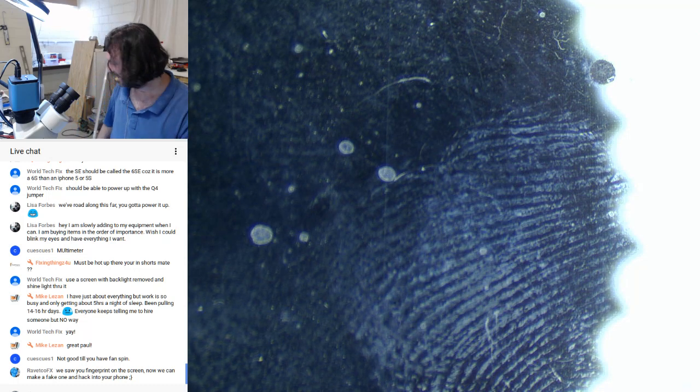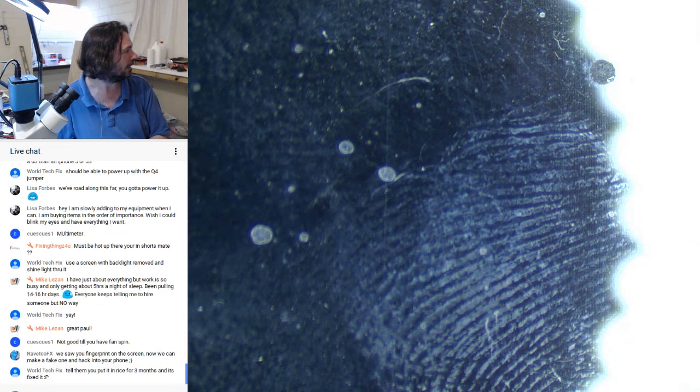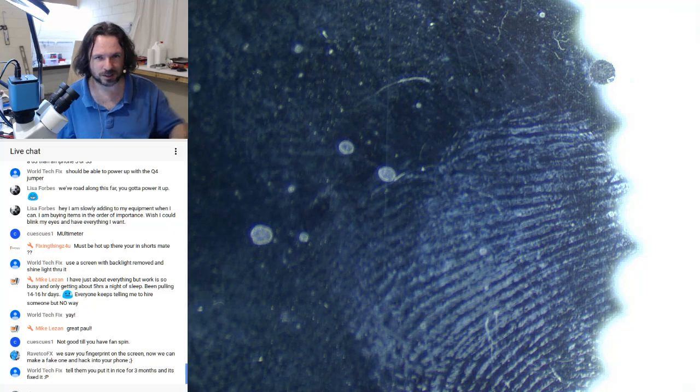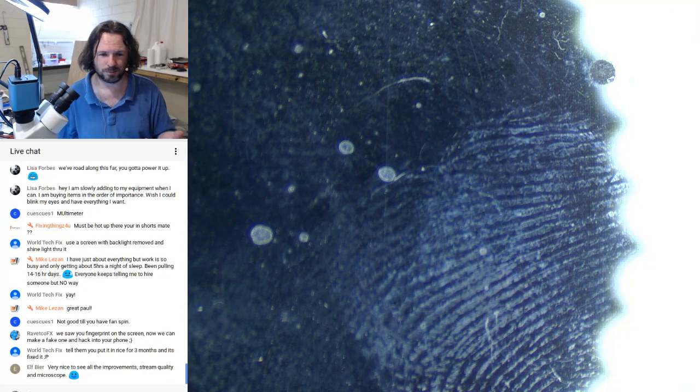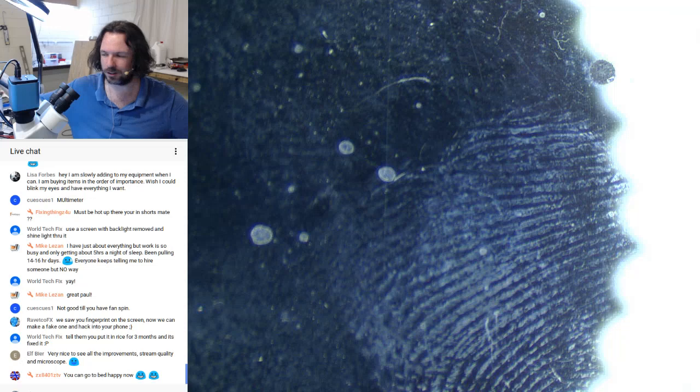Yeah, that's true. My own MacBook has started to fail on me again. This is the one that was soaking in wine for a year. It's doing something strange with the battery. It behaves as if it's running off the battery, but it will not charge the battery. It could just be a bad battery because there's a lot of corrosion in the daughter board that's contained in the battery system itself. It's not part of the main board. But with that particular MacBook, the battery's all just stuck down with adhesive. So it runs for now. When it's running off the power brick, it just behaves a little differently. Like it'll shut down because it thinks it's on a battery and it needs to go to sleep, and things like that.